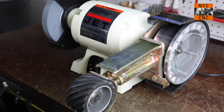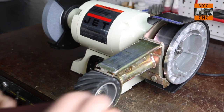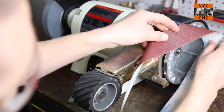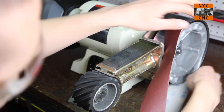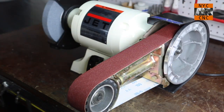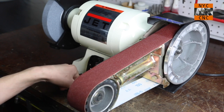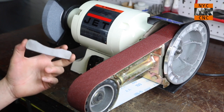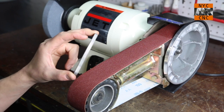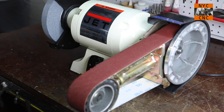One of the things I love about this is it's so quick to change belts, and that really is important when you're trying to work through a part with different grinding processes. You push this in, it clicks, and you just feed your belt over the back half, slip it over the front wheel, and snap it back. This is a 100-grit aluminum oxide belt. Usually I'll use that or maybe an 80, depending on how rough the part is to start with. This part just had the scale cleaned up, so 100 will be fine.